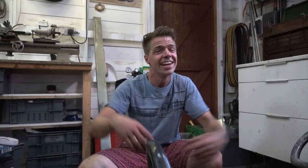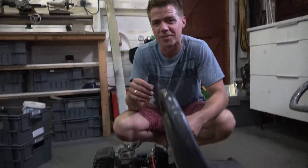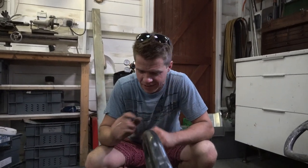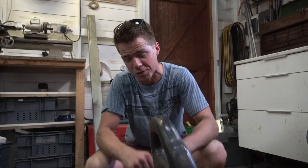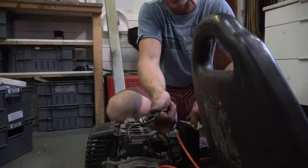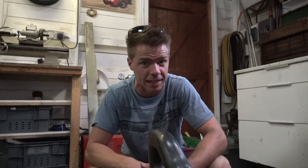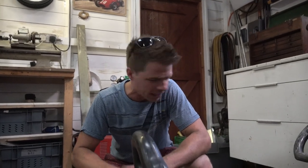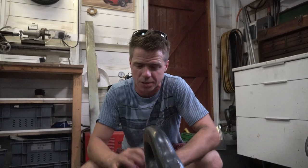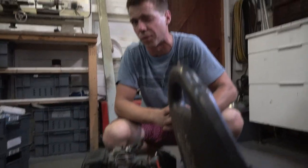So Dudley, that looked pretty darn painful. What happened? It was rather. Okay, so some improvements already are necessary. What happened there was I started it, it ran, but as you probably saw in the video, I touched the top of the HT lead with my thumb and electrocuted myself with quite a few amps. So clearly, before we let any children near this, we need a little protective shroud or something on that to stop them getting their little fingers electrocuted.